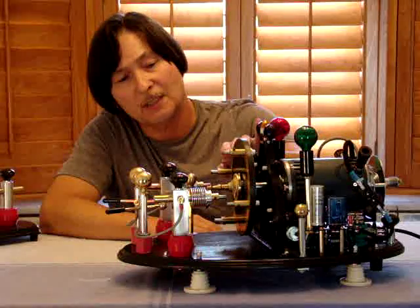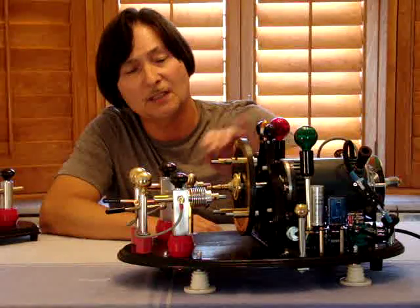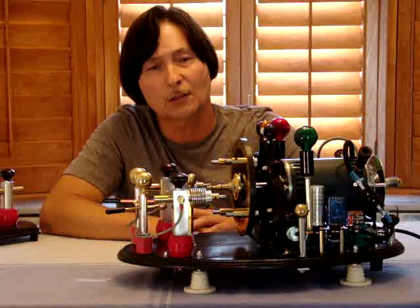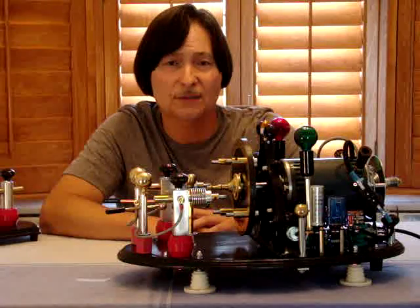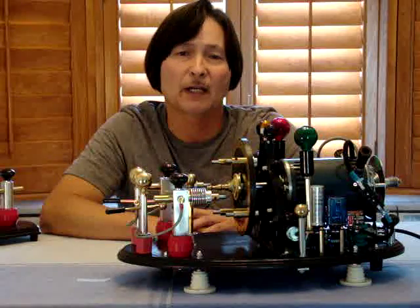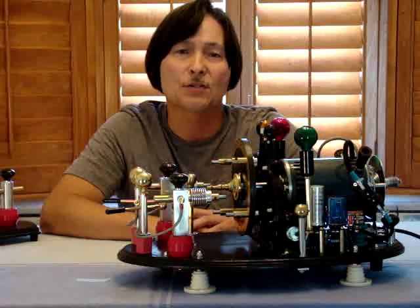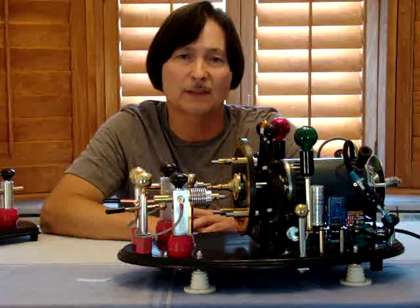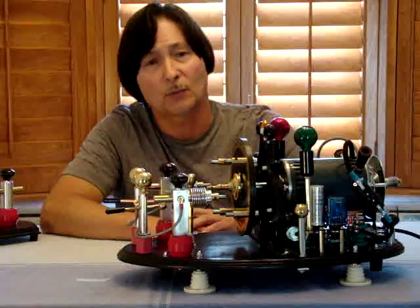All the electrodes on this rotating disc are not perfectly 90 degrees — they're offset a little bit, and that was done purposely. That way the capacitor and the tank circuit have more time to discharge and charge before the next cycle comes around, for more efficient quenching.